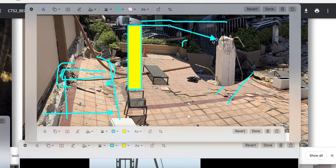Our hinge point is here — not so great, you know, but it's there, some stress. This is probably deflected like that, instead of something like that, but not back to there. That created even more torque action inside here — this going down — so you've got a rotation like this at the bottom half here, putting this in compression, and trying to pry out the top side.